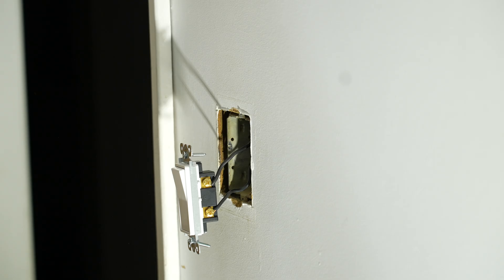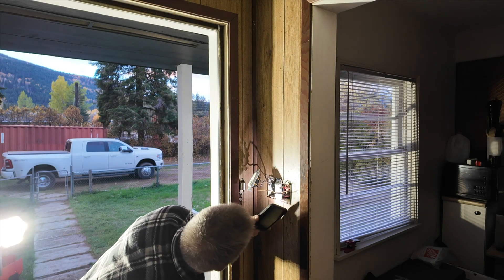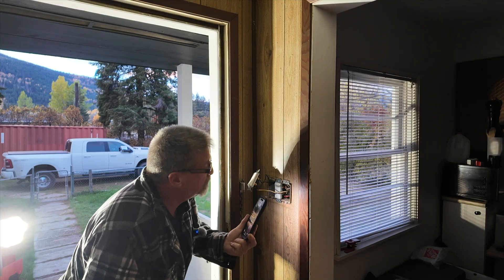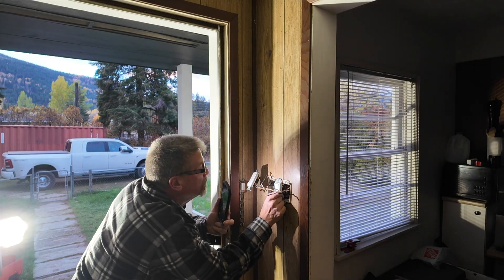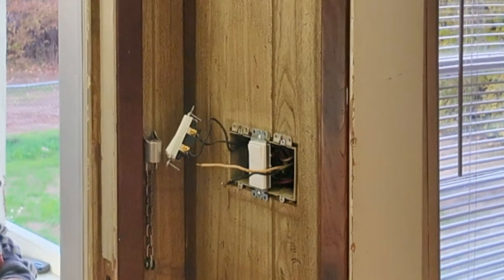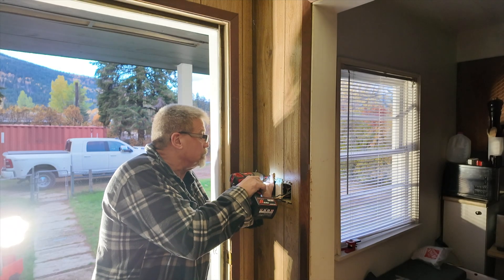The next thing I want to point out is this gap here. If you watch the next sequence it'll explain everything. There's not even a stud there — no stud on either side. What kind of mickey-mouse work is this? I'm going to try to fix this looseness. What I quickly discovered was that the switch box was not attached to vertical 2x4s on either side — they're actually attached to blocking on the top and bottom of the box. This is an easy fix; I can secure the box, but I don't know if this would be up to code.